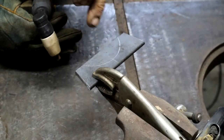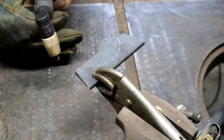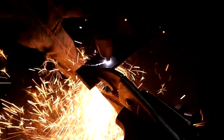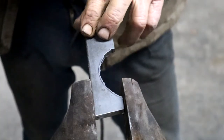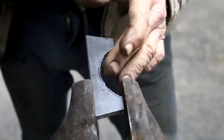I'm going to cut the curved part out with a plasma cutter. Of course if you don't have one you can also use a grinder — this takes a little bit longer. This one is going to serve as my template to make three more, so I'm going to make sure that I grind this one nicely and exactly to the marks.